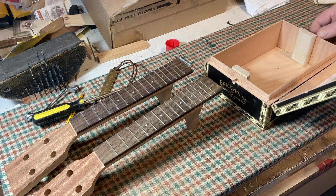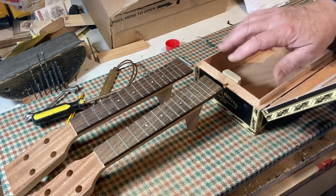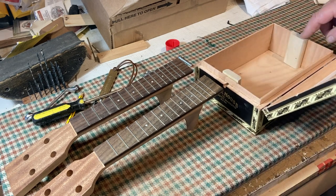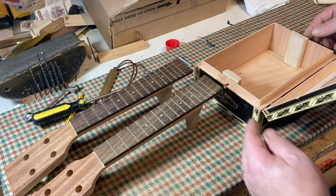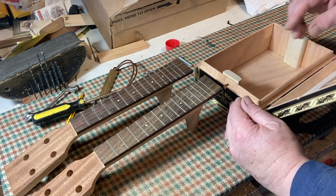What we're going to do is bolt it through here. You can see I've put a heel block in here. This had a liner, which I've glued in place, and I've just put a heel block. I don't really need one this end, but I thought if I'm doing a tailpiece or whatever, just a little bit of extra strength.